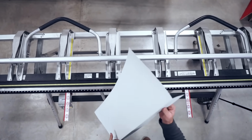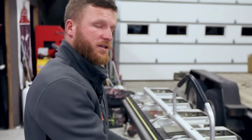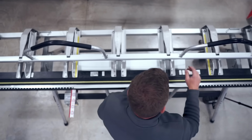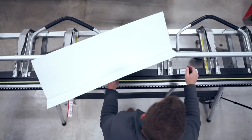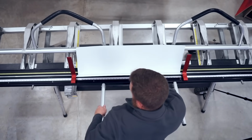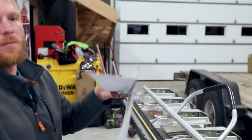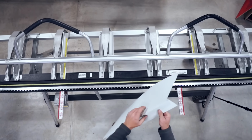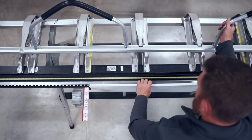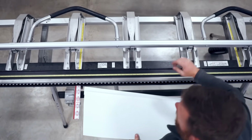Okay, then what we are going to do is flip our material over. And once again, we're gonna be pushing it all the way into the stop here of the bender. We're gonna go ahead and overbend it all the way. And this is basically putting a hem bend in the middle of the panel. So that is what the hem bend is gonna look like there. All right, now the next thing we are going to do is take this 3-inch piece here and stick it in the brake all the way, and do a 90-degree bend.